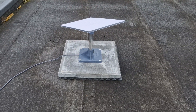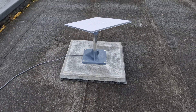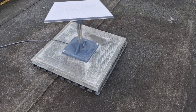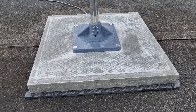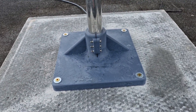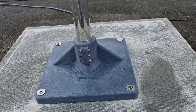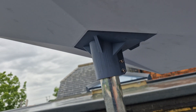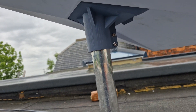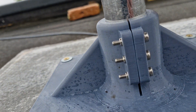Today we're mounting a Generation 3 Starlink on a paving flag for a flat roof mount. We've put the 2x2 flag on a rubber mat so it can't penetrate the roof. The adapter is printed out of PETG, which is really strong. Underneath it we've got one of our custom Starlink mounts on a 1.5-inch mast, with three bolts at the bottom holding it.